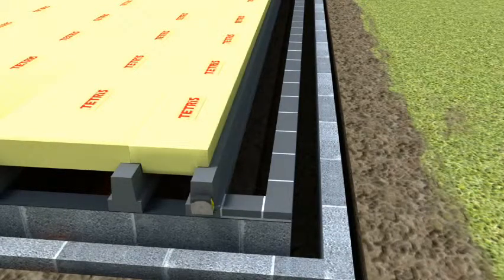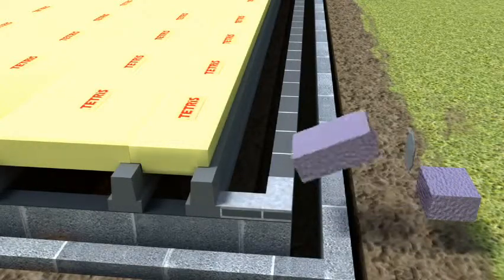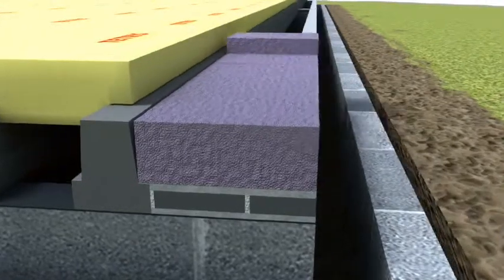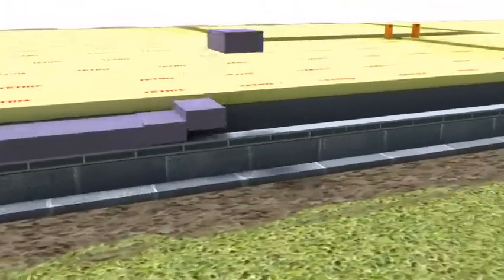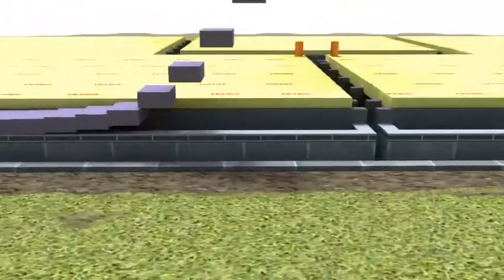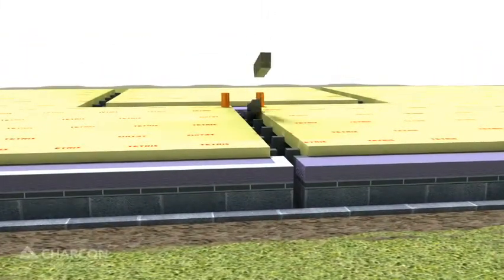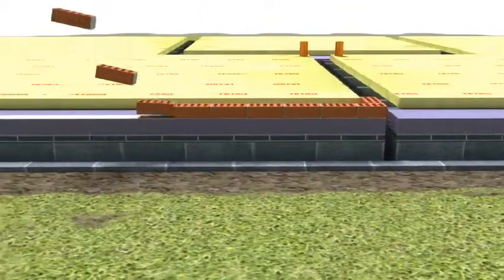When beams are positioned away from the wall, install slip bricks and bridge the gap with concrete blocks. Fill the gaps at the end of the beams with Charcon closer blocks and install the perimeter wall 150 mm high.